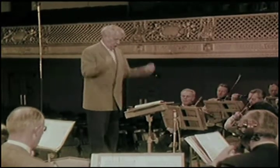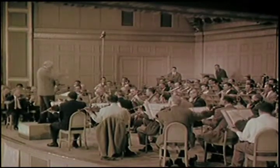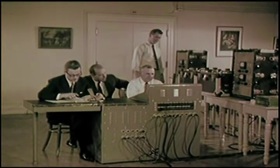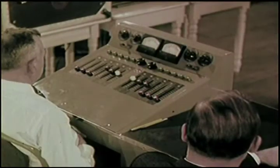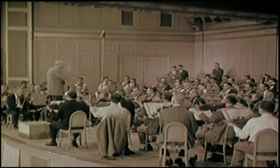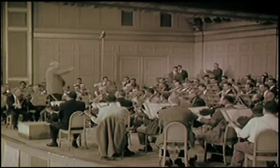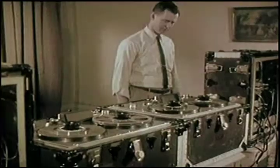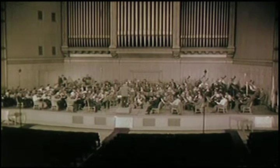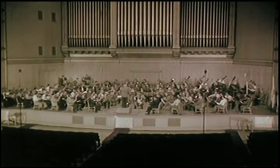An important requirement in a high-fidelity recording is frequency range, capturing high notes as well as low. This is actually accomplished before the session begins. All it takes is recording equipment of enormous cost and capacity, such as this recording console. It faithfully handles all sounds audible to the human ear. The entire frequency spectrum from 20 to 20,000 cycles per second. And with less than 0.2% distortion, it transfers them to the swiftly spinning magnetic tape. A new challenge here is stereophonic recording. This requires dual mics, dual track tape machines, and a stereophonic mixer.